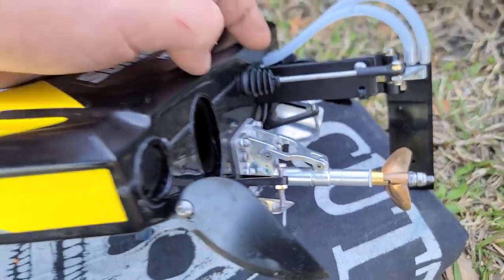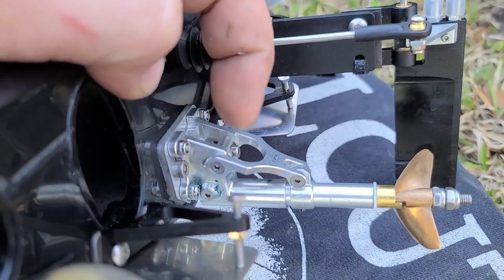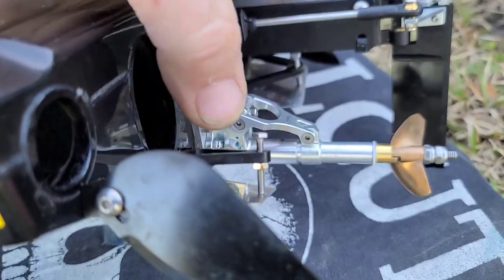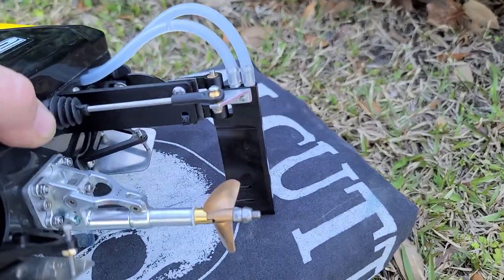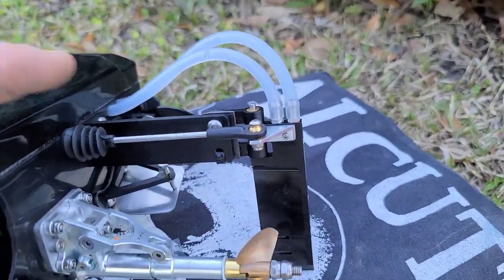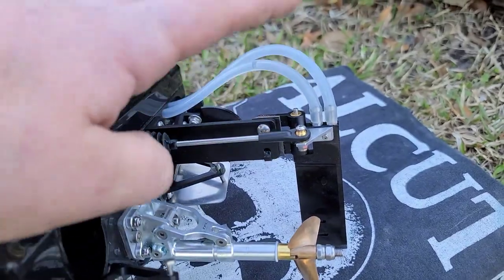The stock strut is longer with a longer bushing, meaning less wear. I don't think it needed two adjustment screws — one would have been fine. The trim tab adjusters, turn fin, everything works as it should. The rudder is shorter and wider on the V2, which should be beneficial at high speeds. In a left turn the rudder actually comes up out of the water a little, giving you a wider turn than the V1. I prefer the shorter, wider V2 rudder — it provides dual cooling and less drag.